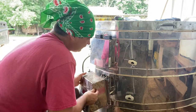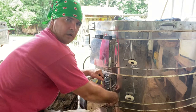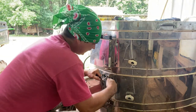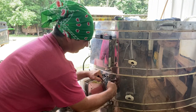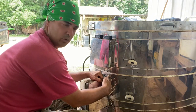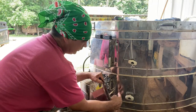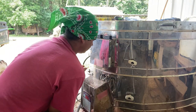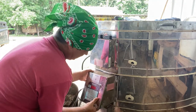What I did — this is my thermocouple, I don't know if you can see that — these four elements I've separated. I put two on one wire and two down here on the other wire, so the bottom two are separated from the top two. You really can't tell in there, let me show you from the top side.